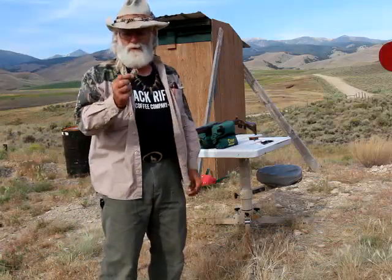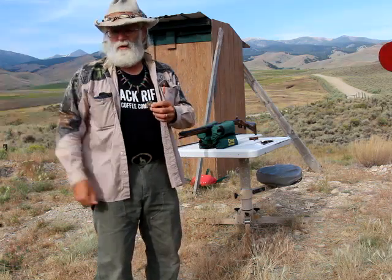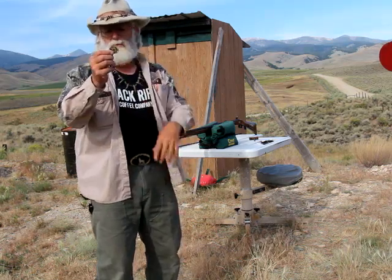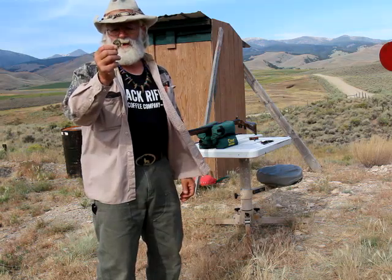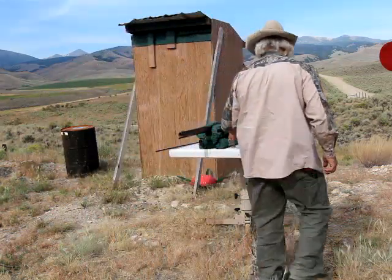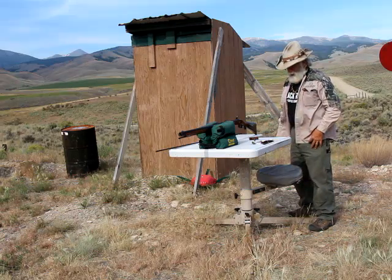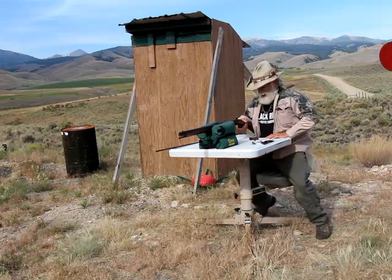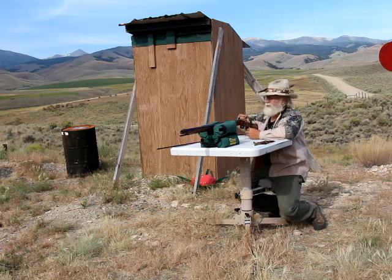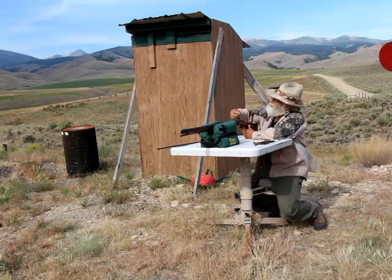Never pass up an opportunity to check your patching. I just happened to find this one on the way back — sometimes they're hard to find, but they're usually within 10 feet of the muzzle. This one has no tears. Powder is perfect around the edge — this is what you want your patch to look like. If I put a little grease on this I could use it again. These are 015s. This rifle works with the 015 patch, unless I use those bullets that I cast — then we're looking into 010 patches. They seem to shoot better with them.